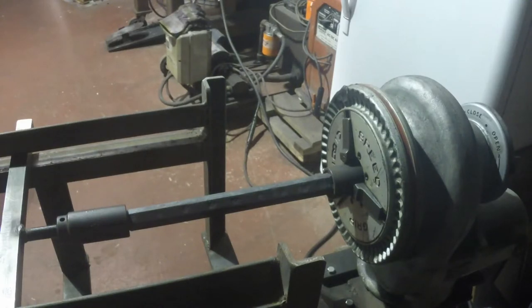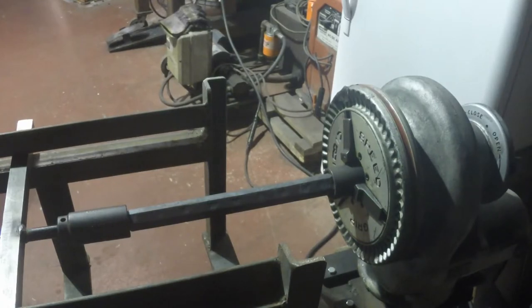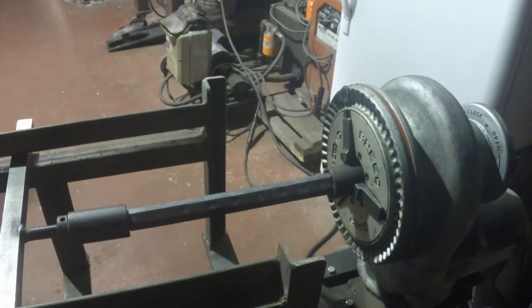Okay, what I forgot to mention was, when I come out of that forge, right over there by that welder, I'm going to have a quench tank, and maybe over there in front of the press, which we'll just be able to see a little bit. I'm going to quench the ends to get them cooler and harden the corners of those square ends so that they don't deform while I'm twisting. So the first thing you're going to see me do is to quench the ends, put these sockets on, stick it in here, and I have a foot switch on the floor. This thing's already hot and ready to go, so all I gotta do is step on that switch and twist this single twist Damascus.